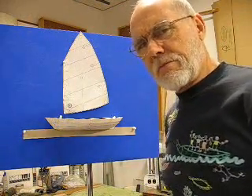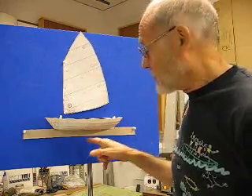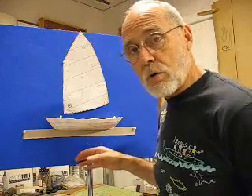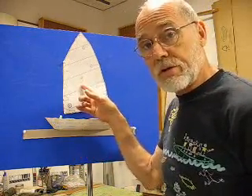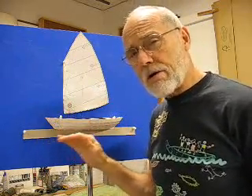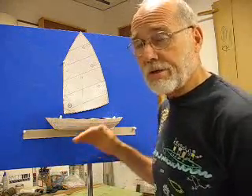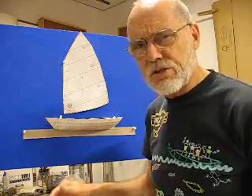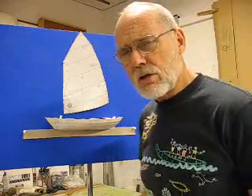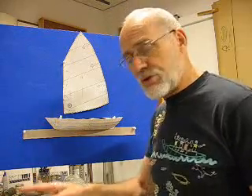Hello, it's that time again for the video on tying the center of effort of the sail to the center of lateral resistance on the hull, so I know where to put the daggerboard trunk in relationship to the center of effort of the sail. First I had to find out where that center seat was going to be, to balance out the hull and place the daggerboard in the seat area. This one seems like it's going to come out a little bit better than my OMP pod — I'll be able to get the daggerboard trunk inside the seat itself.